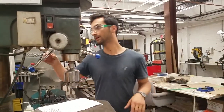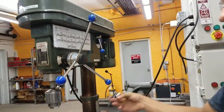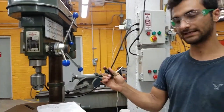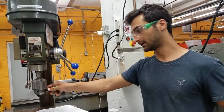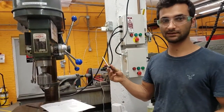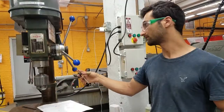There's a chuck key located on the side. The chuck key goes right in here and is used to tighten and loosen the tools. It's a safety chuck key because it has a spring. One of the dangerous things about a drill press is tightening the chuck and accidentally leaving the key in. If you turn it on, the key comes shooting out and can get stuck in a concrete wall. The spring prevents that — it just pops itself right out.